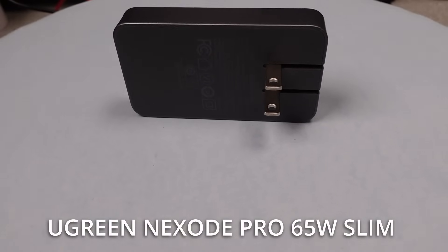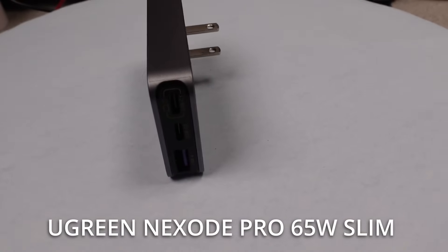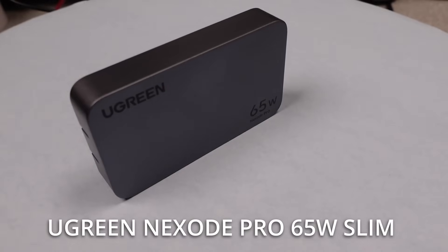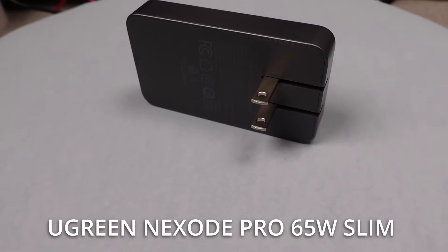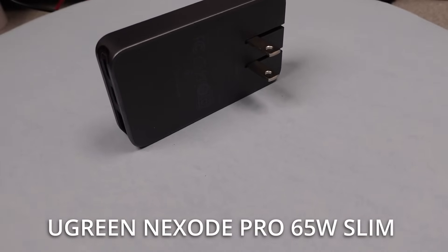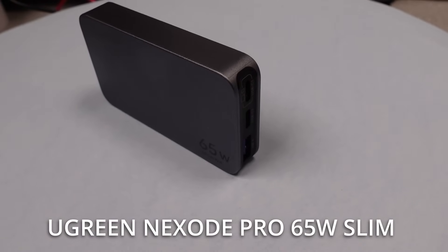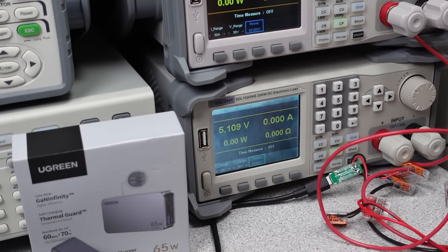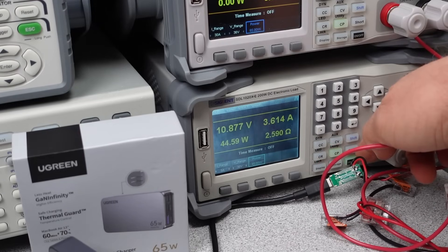Conclusion time. This charger feels new and has everything going for it on paper, and in many of the tests it does well. The charger performs very well on the output side, so no doubt it will charge many devices and function — until the main problem occurs. It overheats and shuts down very quickly: in this case, 18 minutes of run time if you fully load the device, in a relatively cold room. This is too short an on-time and goes directly against the marketing claims. It technically meets energy efficiency standards by a rounding error — bare minimum. It is better than a classic wall wart, but is it better than the other adapters I compared it to? No.